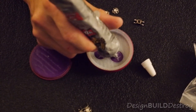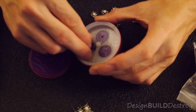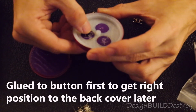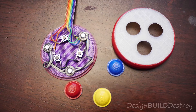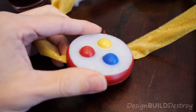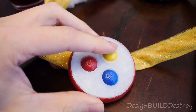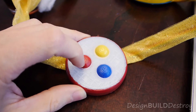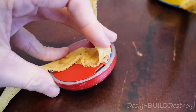The height of the front pack had to be pretty exact so there was enough play for the button to press and pop back up into place without being too tight or too loose. After soldering all the wiring for the front pack, the buttons and NeoPixels were hot glued directly to the bottom plate cover. There's also a notch cutout for the ribbon cable to come through as the shoulder strap. In my original design the cutout was in the wrong spot, so I used a Dremel to notch a hole in the right spot.